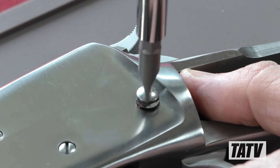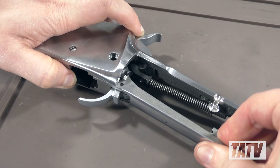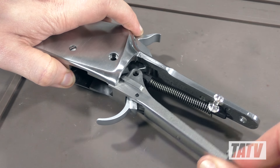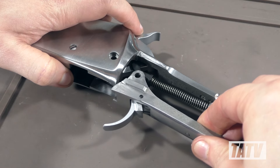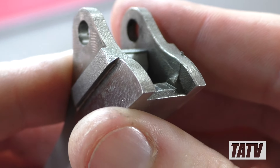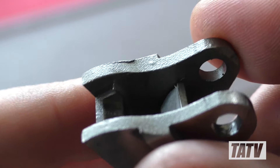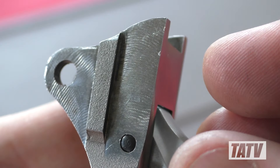Using a slot screwdriver, remove the hammer screw. This will free the lower tang, which can then be slid out of place. Note that this is likely an extremely tight fit, and so it may take a certain degree of finessing to remove. As more of this gun comes apart, you're really going to start to notice just how rough some of that machining is. Tool marks, sprue and casting lines, and burrs are pretty much everywhere — a lot of this will need to be knocked down and polished smooth if we're going to get this rifle into a competition state.